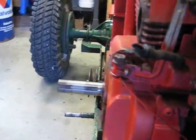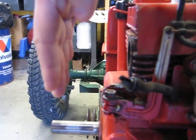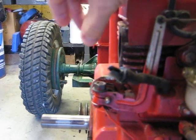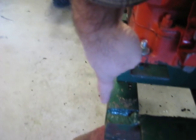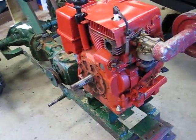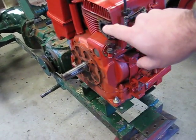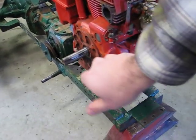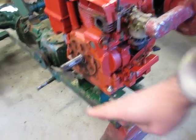When we come over here for an exhaust, I was going to go with the hood being somewhere right in this position to be even. I think what I'm going to do is come out, make a 90-degree bend, and go straight down. Then right about here I'll have it kick out. Instead of having a stack that kind of comes up — which I think is always ugly on these garden tractors — we're going to just go down. One-inch tube, maybe go to one-and-a-quarter inch, and then a nice flared tip going out towards the back.